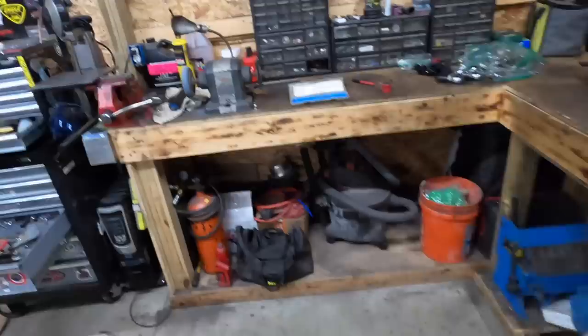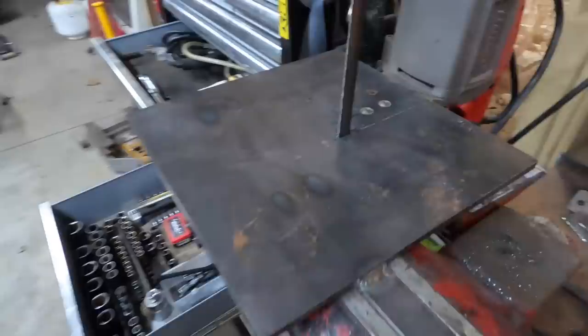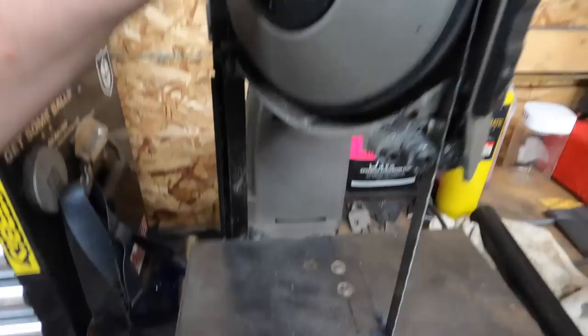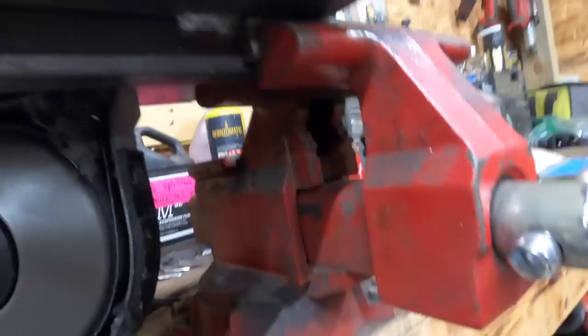It's fun. And in case you're wondering, this is just a Harbor Freight Bauer portaband. And then you get yourself, I think this is like a 10 by 10 plate, piece of quarter inch steel. Cut a slot in it. Take off the original guard that comes on the portaband. Take these two bolts out. Countersink them. Drill holes in your plate. Countersink them. Put them back in. And then I welded a piece of 1 inch square tube on the bottom to mount my vise. I definitely got some fine tuning to do, but...